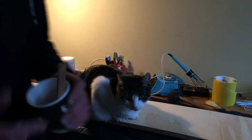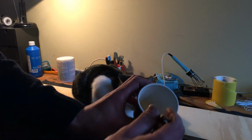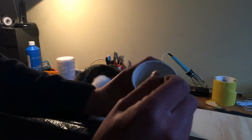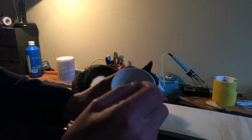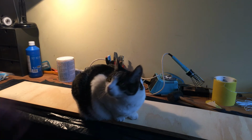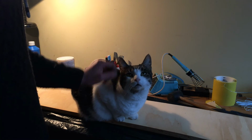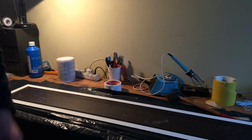Well, I glued this today, and my check to see if the epoxy is dry: you usually have a beaker of some sort with leftover glue, and if it does this, then you're quite sure it's hardened, because it tends to be rubbery soft for a very long time before it really hardens.